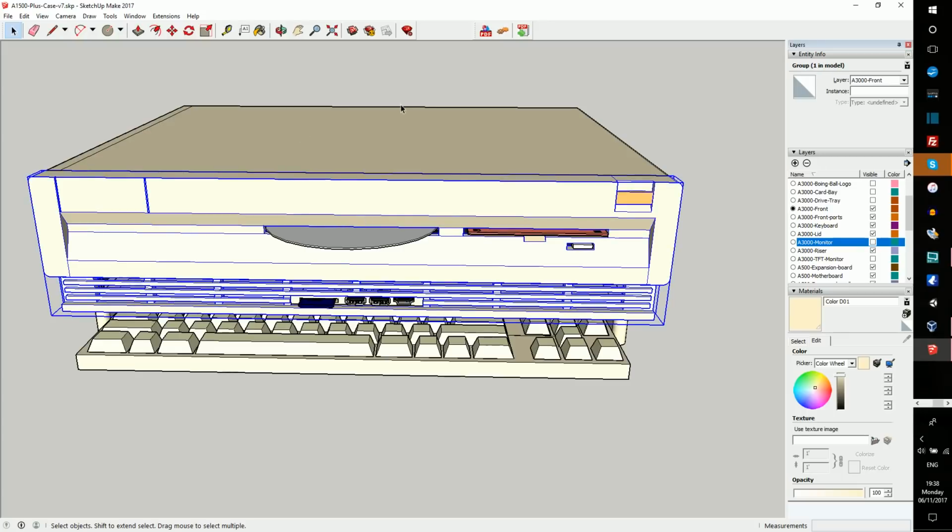So from this line here down, all the way along this line, up and across, that whole section is going to be a second part that plugs into the front. The reason for that is that I will then put this piece back in again as another injection molded part, so it'll look spot on, but you'll be able to take that out and then 3D print your own piece in here. Hopefully over time I'll also do different versions, but initially I'm just going to supply that part. So basically I'm cutting that chunk out, removing it and putting it back in again.